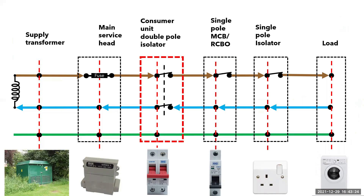The process repeats itself as we work our way through the circuit, with the exception of the consumer unit's main switch. Unless there was an external isolator between the electricity meter and consumer unit main switch, you have no way of isolating the supply from the main service head, at which point you should contact the DNO and ask them to remove the fuse for you. This will enable you to change the consumer unit safely, and it would probably be worth putting an additional isolator between the meter and the consumer unit for future consumer unit changes before the DNO replaces the fuse. This may not be an option in assessment situations at college, and it's currently not an option for the AM2. This means your only option is to go through the safe isolation procedure by seeking permission, switching off the main switch and locking this off before gaining entry, so that the supply side of the main switch is the only thing that is live, before proving the load side of the switch is dead.